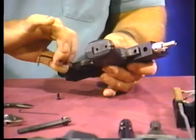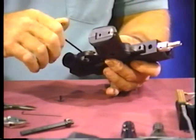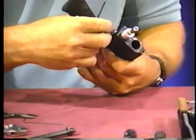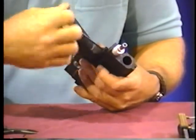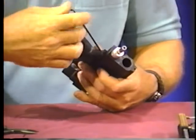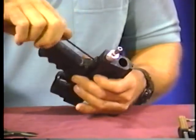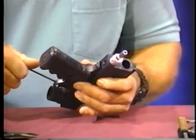Always, every time you start a screw, you sit there and you do it with your fingers, real lightly. If it doesn't go straight, you're going to strip it, then we'll have to helicoil it at the factory. Yeah, that's the easy way to ruin a body, is to cross-thread it. Remember, the body is aluminum, the screws are steel. The screws are going to cut the aluminum if you don't align the thread holes correctly.